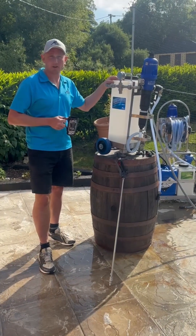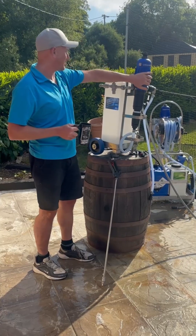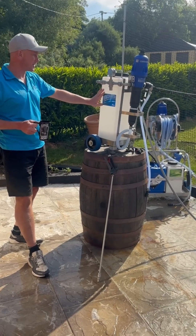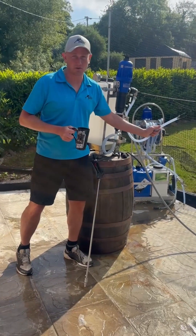Let's talk about the lightning zap. How long have I got? 90 seconds. Okay, so let's start with the main Godsoft machine, which is this D3 Dosatron here. This will take your raw chemical — your lightning cleanse, which is a sodium hypochlorite-based biocide — and dilute it and deliver it out to the outlet to where you're doing your soft washing.